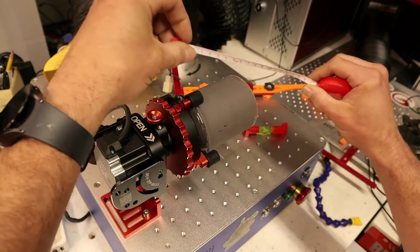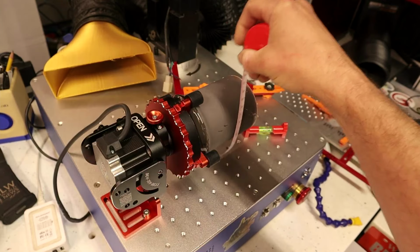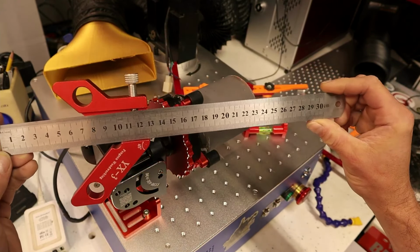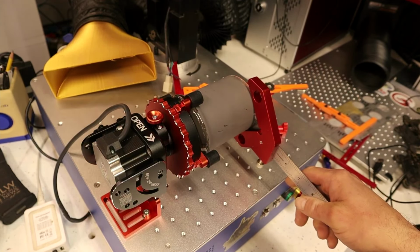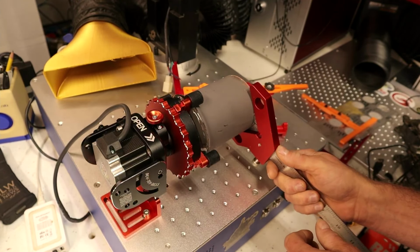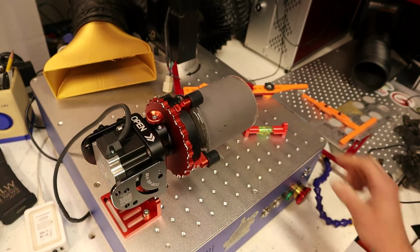I thought I would just test the circumference out with this little tape measure. Let's see how it measures up. .251. Now, here's a tool that I use often. I'll put a link in the description for this, but this is a center finder tool, so you can find the center of an object, but it's also handy for getting a quick measurement of the diameter. Basically, pop it on the end of your cup, glass, whatever, line the end of the ruler up, and then you can look and see that this is 80 millimeters. But if you need to find the center of the circle, you can use that as well. So 80 millimeters is what we'll set that up as in LightBurn.